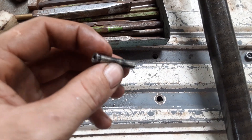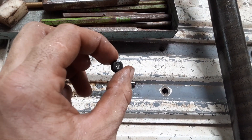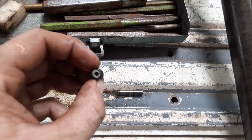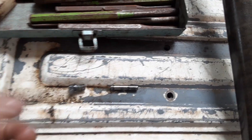It's an easy out to get that out. What you do is go up to your drill press, or your mill, whatever, and you drill a hole right in the middle of that bolt. I chose eighth inch — you could probably go a little bigger, but eighth inch seems right to me.